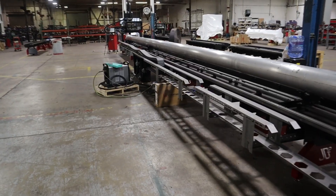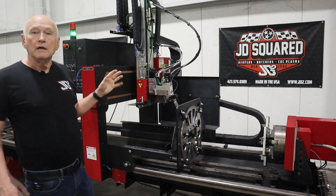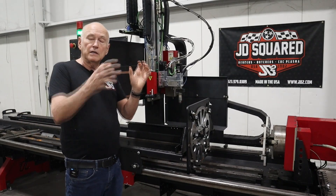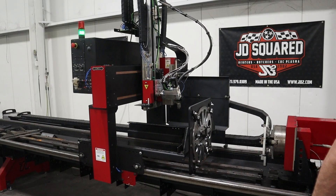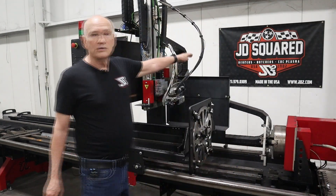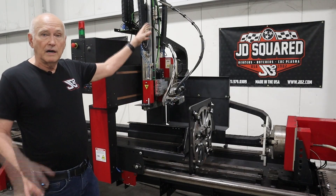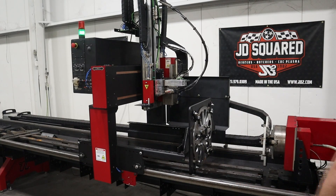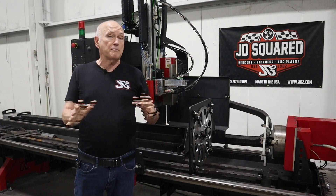Here's the BLE going through its paces. You can see it tilted — we're only at 45 degrees right now — but the BLE will completely turn sideways. The idea is to cut structural steel by turning the torch sideways instead of rotating the steel. Let me stop it and demonstrate: I can orient it like this and now I'm cutting sideways. When I originally developed the BLE, the intention was to only tilt in two directions, which covers most structural steel work since very little of it requires angled cuts — pipe chamfering is the main exception.